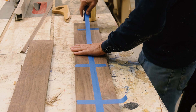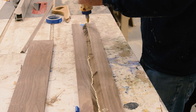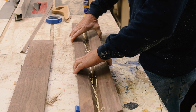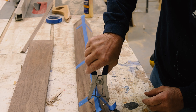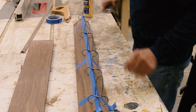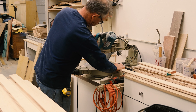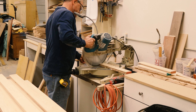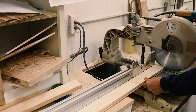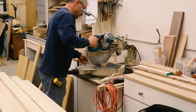The walnut panel is going to have a 45-degree miter in it. I cut that one first so I could go ahead and do this miter fold technique that I use on most of my corners. I have these little spring clamps — I can't even remember where I got them — but they're nice for holding miters together.